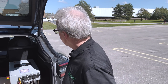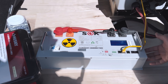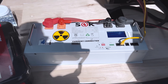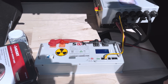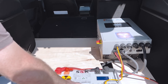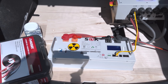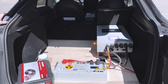You see it's a 5 kilowatt-hour battery with an oddly symmetrical charge and discharge max current. Can you comment on that? It's a lithium iron phosphate chemistry, which is nice and safe and reliable. I think what they did is simply design it for a 1C rating because there's no active cooling — no fins. They just lowered the charge and discharge current down to where you could be safe without any additional cooling. With LFP, that should be quite easily achieved.